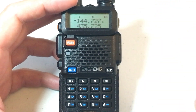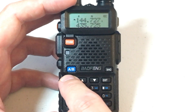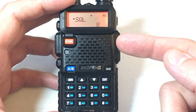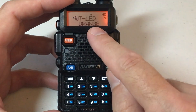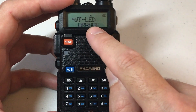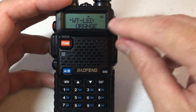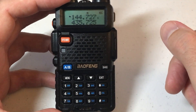The way we're going to do this is go to menu number 29 on the radio. Start by pressing the menu button - it'll take you into whatever was your last menu item. Simply press 2, 9 and you should end up on a screen that says WT LED and shows your current color, with a blinking 29 indicating the menu item you're in.